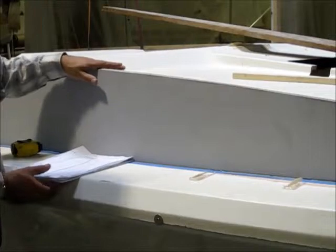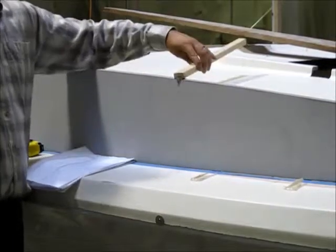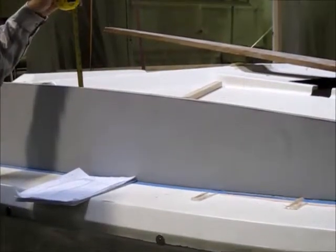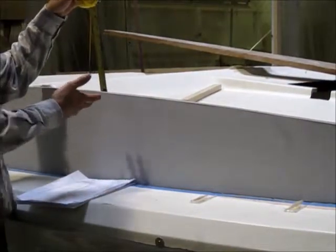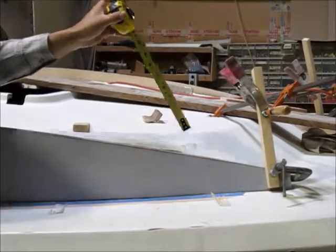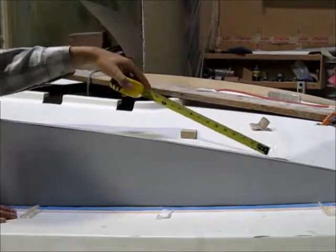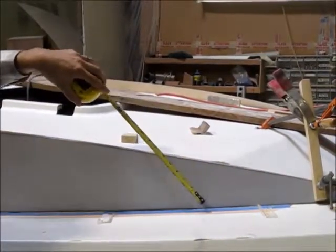The finished deck is going to be half an inch above this, so our board is going to sit on top of that. Comparing it with our existing deck and measuring here, that's showing two plus a half inch — so two and a half inches higher. We're going to have more headroom inside, and it goes down to about a half an inch higher here. In the corner the old deck had a very small radius — we're going to increase that to six inches, so somewhere back here it's going to start curving.